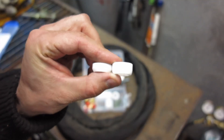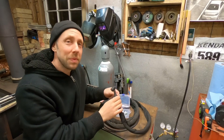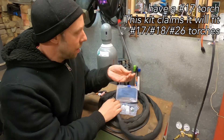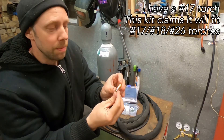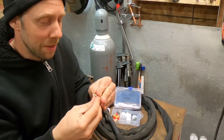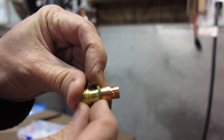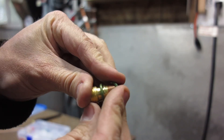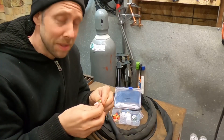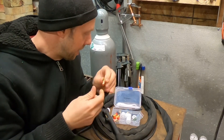Even the bottom Teflon ring is shorter with the new kit. Going to put this torch together - start with the little snap ring, the little white ring. Found it's a little easier to roll the o-rings on the back side rather than over the large threads - put two of them on. I think this kit is probably going to help a little with the learning curve - illuminate the area better, torch will be shorter, maybe more comfortable to control. But I don't think it's going to replace just spending a lot of time practicing - it really comes down to taking time and practicing.